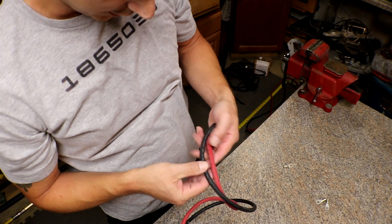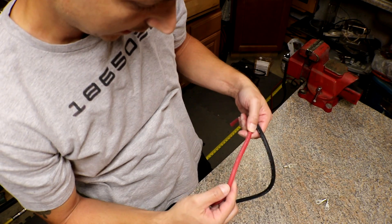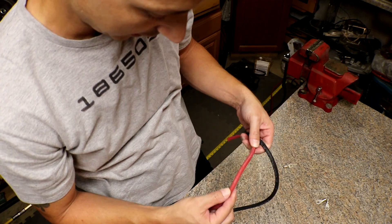I'm going to start making the wires from the charge controller to the battery bank, about eight feet long. That's because I want to be able to pull the power rack away from the wall if I need to. This is six gauge welding wire as well — I can leave a link down below if you like.